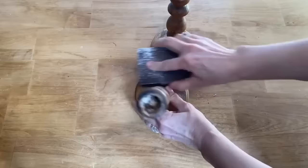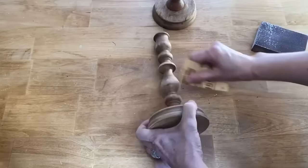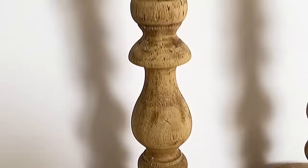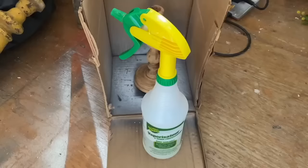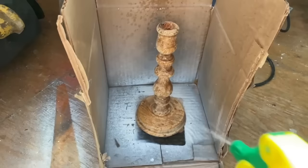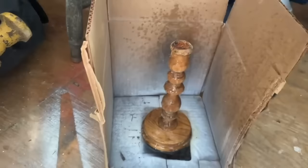I'm going to scuff sand these with a sanding block. We don't need to take it down that much, just give it something so we can get that top layer of that orange tinted stain off. By sanding these it does work pretty well for bringing them back to life and making them not scream '80s. But I'm going to show you how you can bleach wood and bring it up to an even more modern looking piece that you would find at a big box store. This is just some bleach and some water — we're just going to spray it on the candlestick and let it sit. This works really well in a good ventilated area because it's bleach, so you don't want to be doing it right in your house.